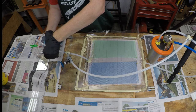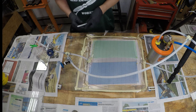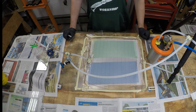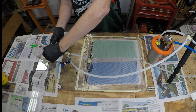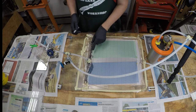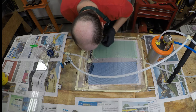But it turned out that during my vacuum test I found there was a very, very slow leak and I just could not locate it. So I decided to just go ahead and run this and see what happens. Initially the flow rate was way too high and I had to cut it back a little bit. The blue side started out pretty fast compared to the green side because a small portion of that blue flow media was underneath my spiral tubing, whereas the green side had none underneath it. So that let the epoxy flow much faster into the blue side.